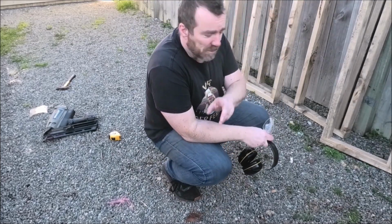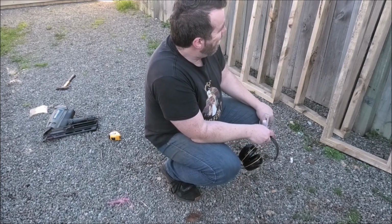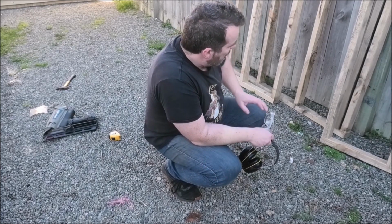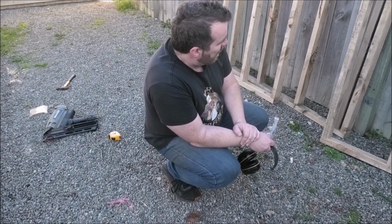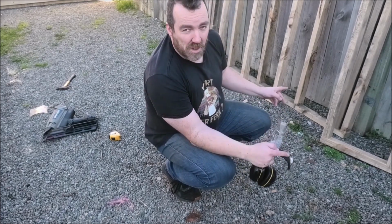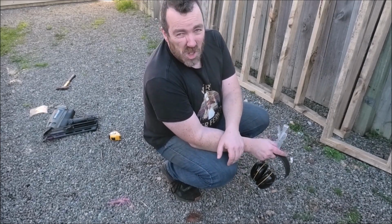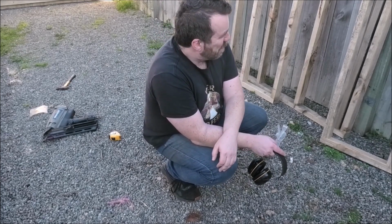So that's all the framing that I'm going to do just now. That's the side walls, which are the short ones, and the back wall. Now the upright pieces, called the studs, when I'm building a shed or anything large, I'm more particular about where they go. I would normally do those 600 millimeters apart, and that's because a standard sheet of plywood or plasterboard is 1200 millimeters wide. So it's divisible, and that's the way buildings are typically built here in New Zealand, but it's just a wood shed. And I already know how I'm going to orientate the plywood, so that's not necessary.